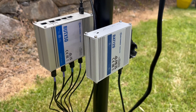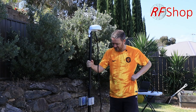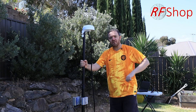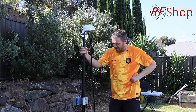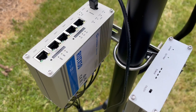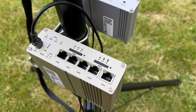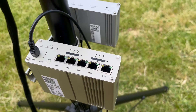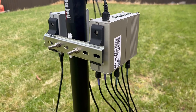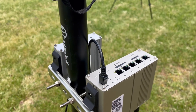You power it up, then unplug the power and it just keeps the system running — so it can act as a UPS. In my case, this whole setup has no connection to my house and is fully up and running right now. It connects to my RUT X50 5G router. Both are Teltonika devices; they do have communication between each other if you want, but I just use it as a plug-in device. The Teltonika router has all four antenna ports for 4G and 5G.